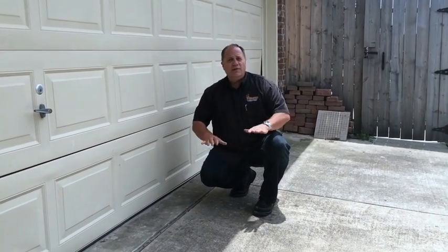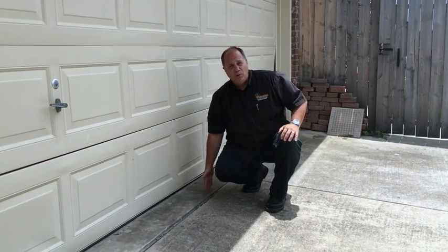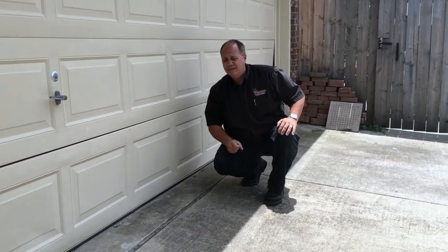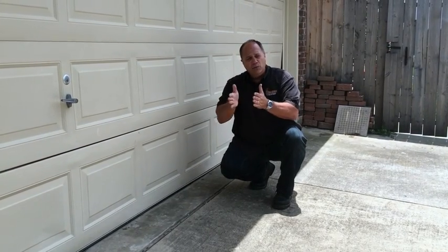The foundation here and the concrete acts as an evaporative barrier to help hold moisture into those soils. But over the summer, it will dry out, so we want to add moisture on a regular basis. So once a month, maybe twice a month during the hot times, 1 hour along this gap. Also, if you have that same thing at your house patio, if you have a gap, you want to run it there as well.